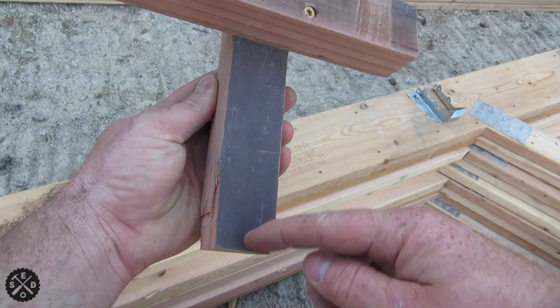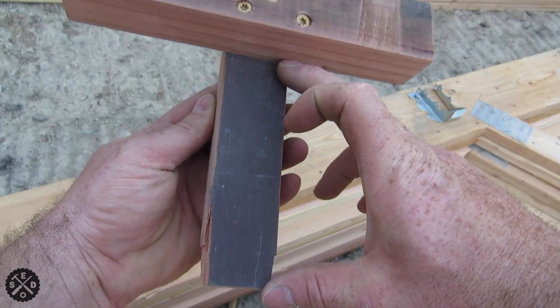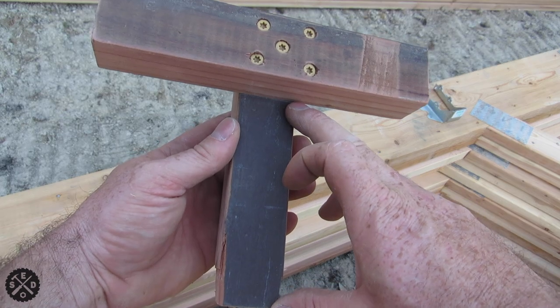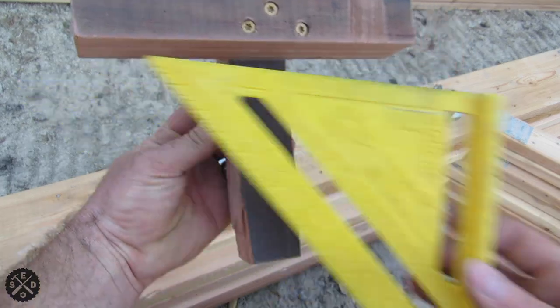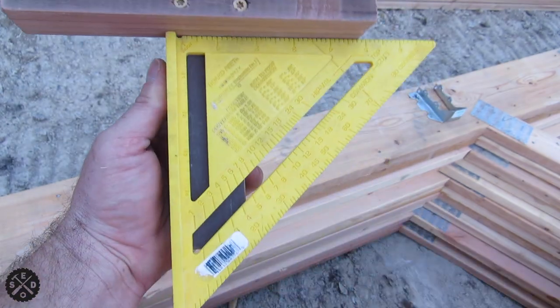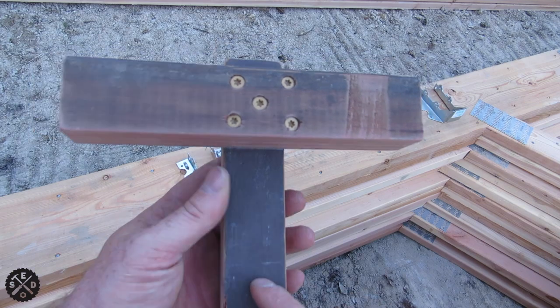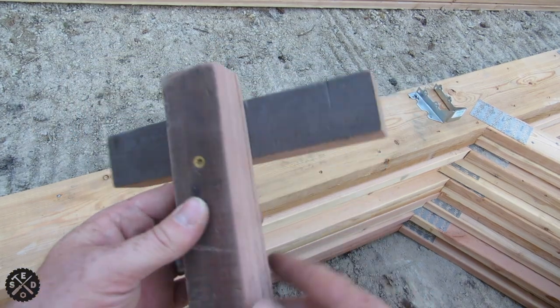I made it about five and a half inches exactly — the width of a two by six. You could do seven and a half or whatever your two by eight is if you're going bigger, or for a two by four. I used a square to make sure it's nice and square both ways, then tightened it down with lots of screws in each corner and even one in the back to make sure it's held firmly so it can't move around.